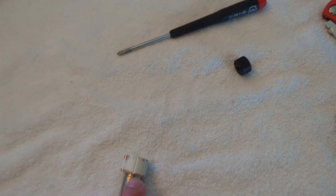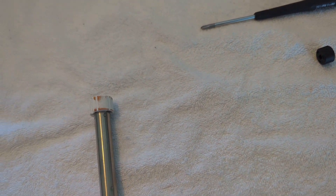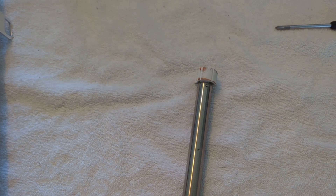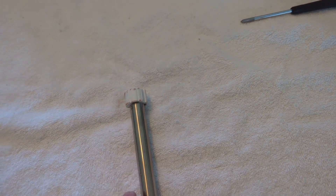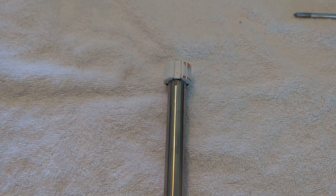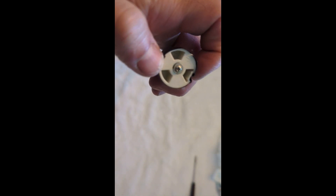What I'm going to do is wrap one layer of electrical tape — that'll be just enough friction to move the shade up and down. And if you ever mess up the limits and the motor drives too high and gets jammed, it's going to slip, which is probably for the best because you won't damage anything. The downside is you'll have to reteach your limits. I'll wrap that and show you the end result — there it is. You can see the two grooves.